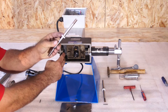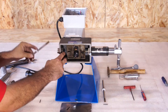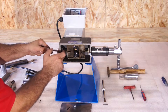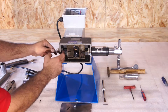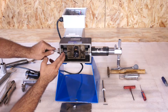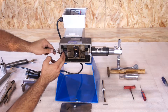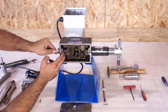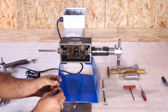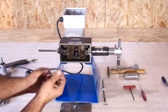Next, take the plunger that you're going to be replacing for your new head. Insert your plunger through the bushing and into the reciprocating block. Line up your hole with your access port. Once you have it lined up, take your roll pin.